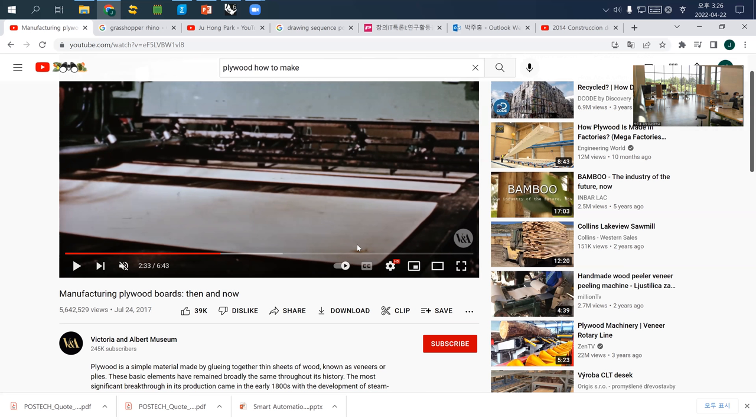And then there is medium quality plywood. They use some damaged wood in the middle, and only the front cover and back cover have the finest quality plywood. That's the middle level, and the lowest quality one is weak, but it doesn't really matter whether it has a mark or not, it's just bigger. So there are three different kinds of plywood.